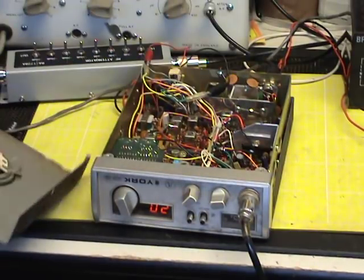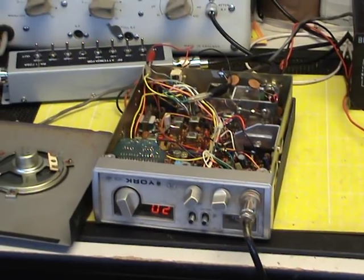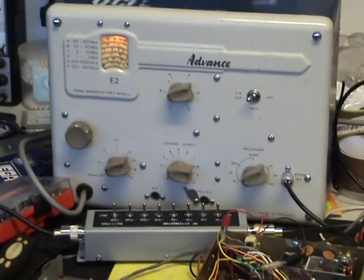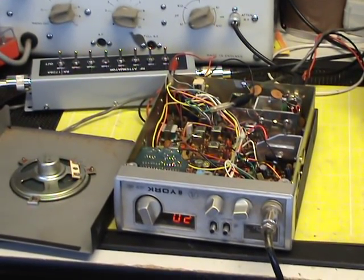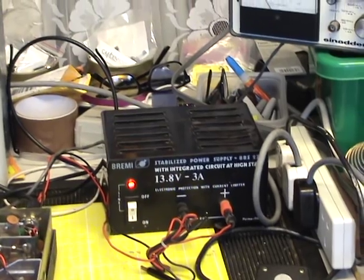It's lovely and dusty — in fact, I think we'll do some cleaning as part of this video. I know it's on frequency, and it's important we always do transmit first. We know the VCOs are working. I could connect that to a frequency counter, but it's probably about as stable as a bag of worms on these frequencies — great for transistor radios on medium wave, but not so stable up near the top end of HF and into VHF. We're going to be using the power supply that we serviced the other day.